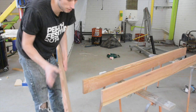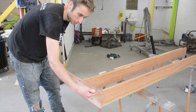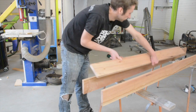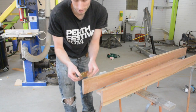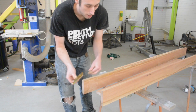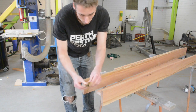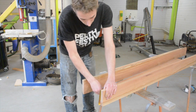This has to be broken down so we can't glue it together. You could potentially go straight through with a couple of screws — just no glue — but something that looks a little more professional is using essentially the same hardware we used on the base, just the longer version. This is a 125mm long maxi lock; the ones we used on the base were 85mm from memory. This piece gets mounted on the inside of the rails and this piece gets mounted on the footboard.